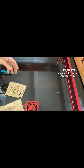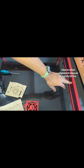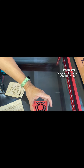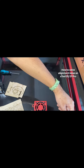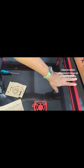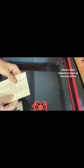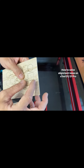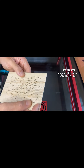After trying and adjusting the tension of the belt and stuff like that, I finally managed to get it right. A lot of experts say it's going to be the tension from either the left or the right side — both sides of the tension — or the X-axis belt. I did every single thing mentioned about tightening the tension belt, but I still could not get it right. I may be able to get a true X-axis measurement of 10mm or 20mm, but on the vertical Y-axis it's always short by maybe 2mm or so.